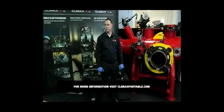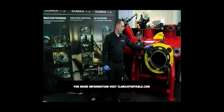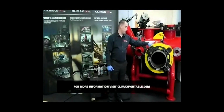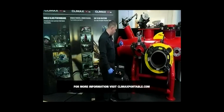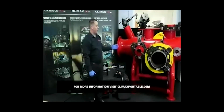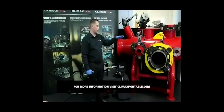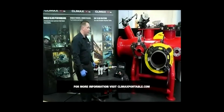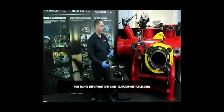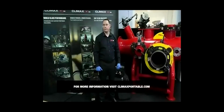Can I use it for my existing machines? Again, absolutely. So the guard itself is bolted to the existing bolt pattern within a standard machine. So there's no modification to the machine needed at all. You can integrate the remote pendant, again, directly to a standard machine. It'll just be the automated trip system, the remote pendant, the Defender air caddy, and also the guards themselves, but it can be fully integrated into a standard machine that customers have bought from many years ago.